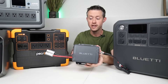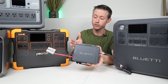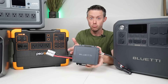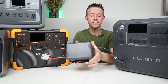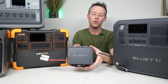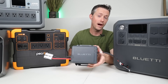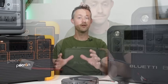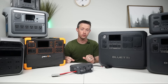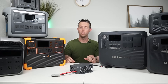Taking a closer look, this side is designed to connect up to a 12 or 24 volt battery — whether that's your vehicle's starter battery or a standalone DIY expansion battery. This side has MC4 connections to connect up to your power station. What it does is take the low voltage of your battery and boost it up to a higher voltage so your power station can charge faster. The main advantage is you no longer have to rely on solar to fast charge — you can now connect to a battery and get over 500 watts of input.